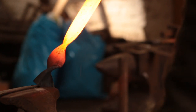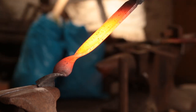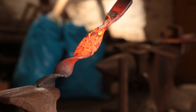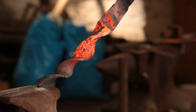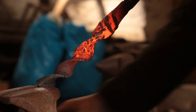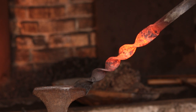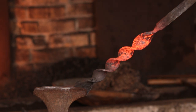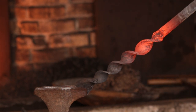At this stage I will start twisting. The camera didn't record the first part of the twist, but basically I took a four inch heat on the end and twisted the business end of the auger first — I did that at close to a welding heat to stop the forge welded carbon steel from delaminating. I'm doing it in sections in order to keep it accurate and to stop the twist from collapsing, because if you over-twist flat stock it will collapse into a tube. It's quite a nice effect if you're doing decorative ironwork but not so useful with an auger. Coincidentally, it's also how the Anglo-Saxons used to make their wire.